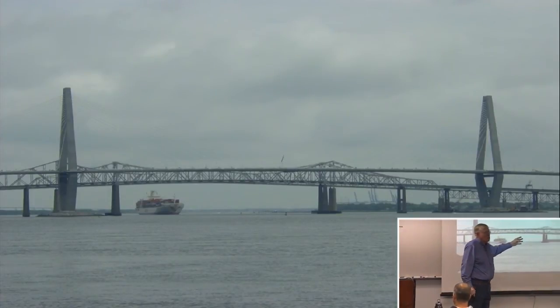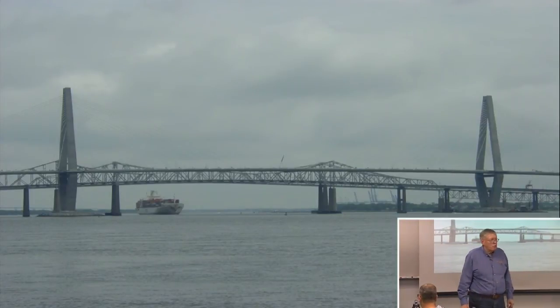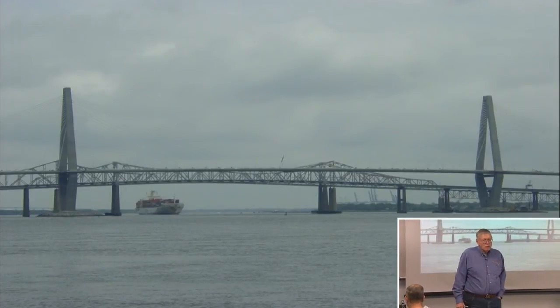This bridge's towers, for example, were designed for 195-mile-an-hour sustained winds for a hurricane. At the same time as that hurricane wind, it was designed for carrying approximately an 8.0 earthquake hitting it. And then it's got an island at the piers that's an acre at the surface and 5 acres at minus 55 feet that run up and downstream. The islands are designed to stop a 50,000-ton ship moving at 10 knots, either up or downstream. So there were some interesting design criteria in this thing.